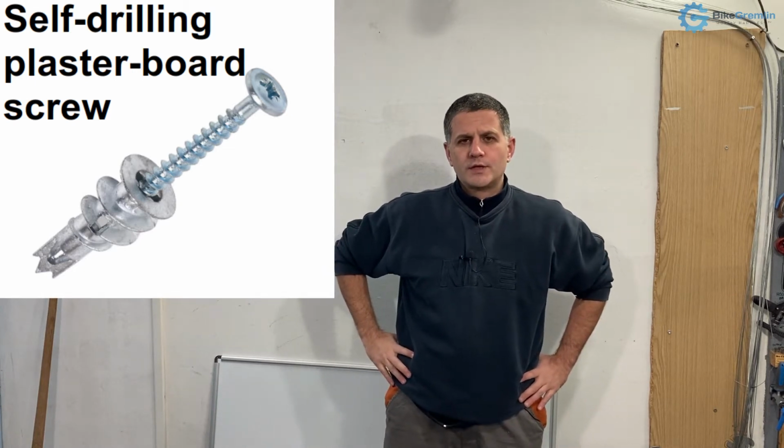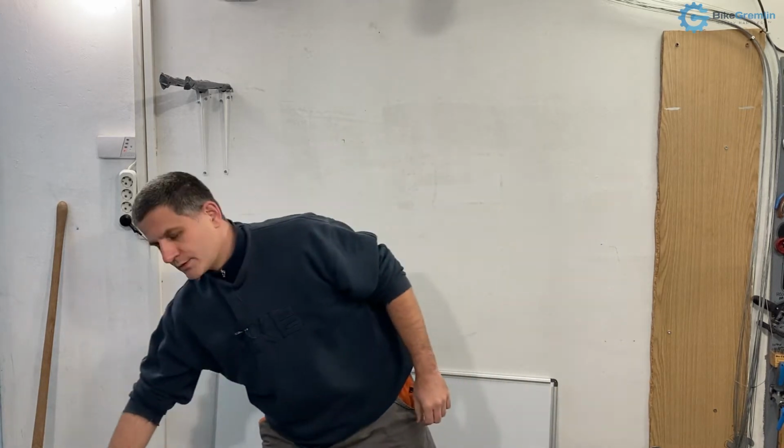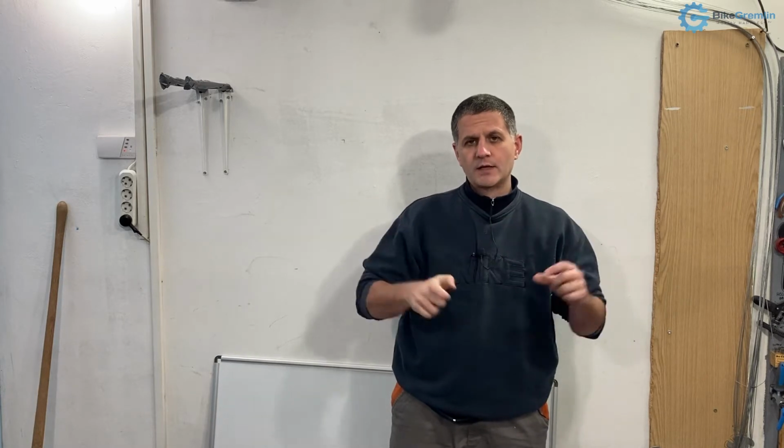And also I think it is a good idea to consider that those plaster walls often have some sort of wooden brackets that hold them in place, and I prefer, when I'm mounting on walls like that, to figure out if I could use one of those and then put a screw for wood into those, because I think it's a bit firmer and holds better. But you need to be very precise in measuring and know exactly where those are placed, so it's tricky.